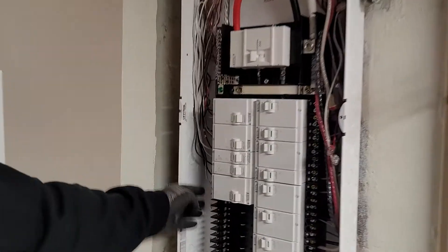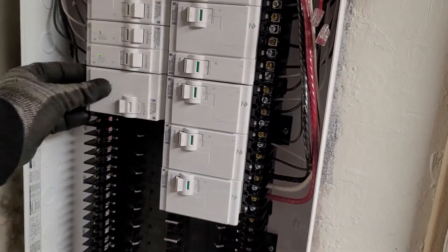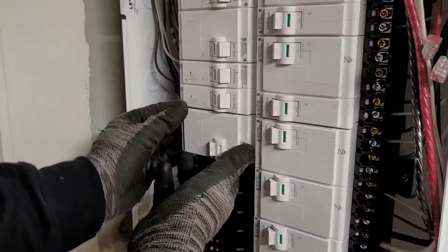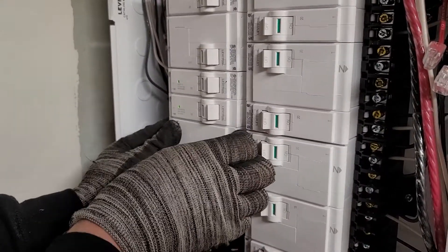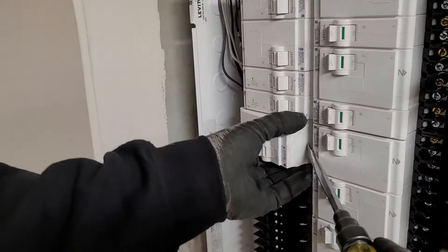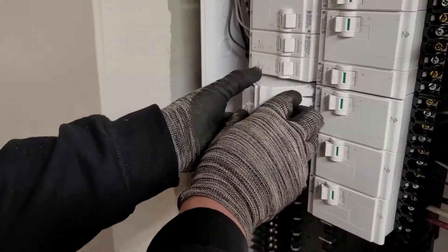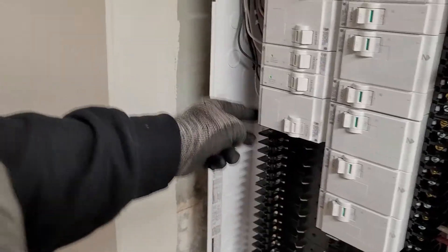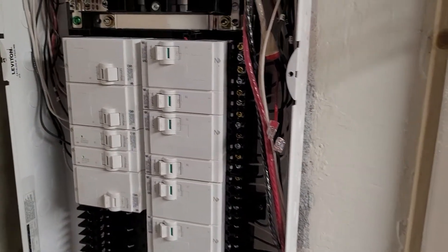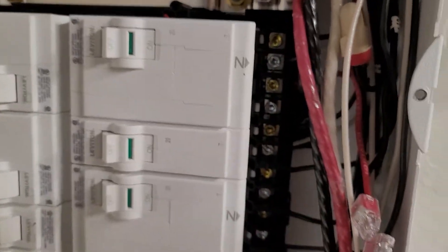The wiring actually lands on this right alongside the breakers, and no wires actually land on the breaker. So any homeowner could easily just take a breaker and pop it out themselves. You can just pop the breaker out and replace it yourself — you don't have to do any wiring to it at all. The wires just land on the bus in front of the breaker. So that's the big upgrade and the big difference: instead of running the wires to the breakers, the wires are going to the buses on the sides.